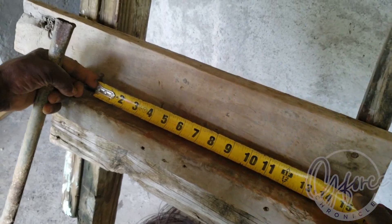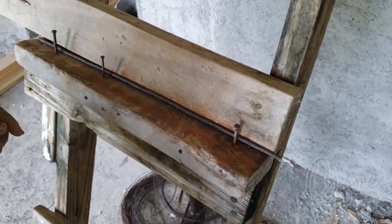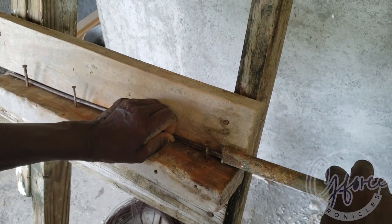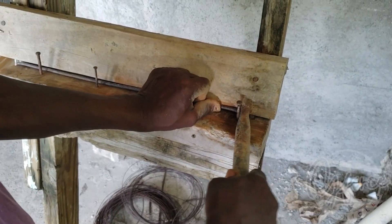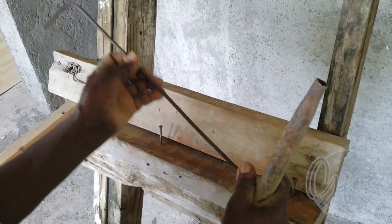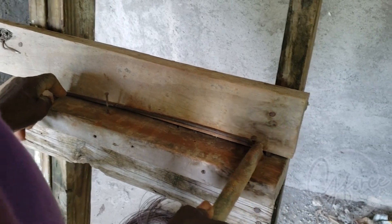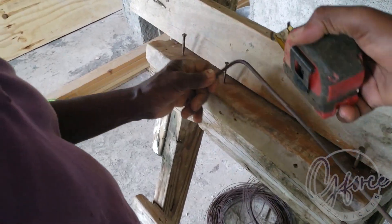From point A to point B - exactly 14 inches - you put the nail in there. This is how you use the quarter guide, that type of wood. So that two inches: when she bends off, she bends off the first end which is two inches. You can get a little longer than two inches, but you still bend it off once you make the finish of 14 inches, so there's concrete coverage on each side when you pour the foundation.